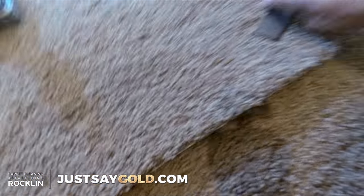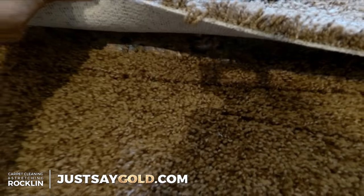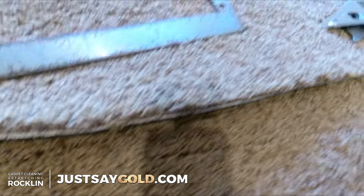After the carpet is stretched over, I use some sort of straight edge to mark where I should cut, and then I just use my top cutter and make my cut for the seam.